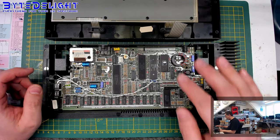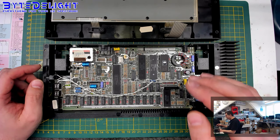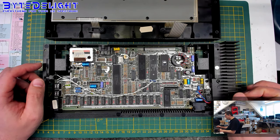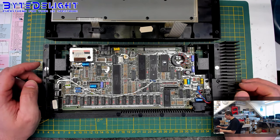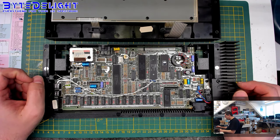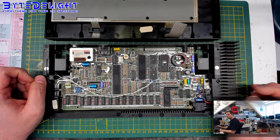So it's important to know what you are connecting if you really want to make sure. Mostly it's good to use a 1.5 or 2 ampere power supply to make sure that your power supply can handle the power that is needed. And this one should be a 2 ampere type, just to make sure.